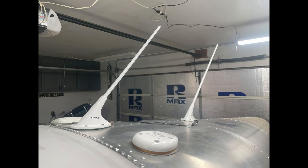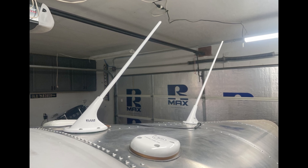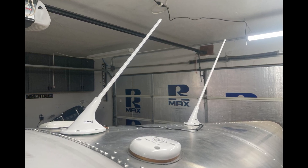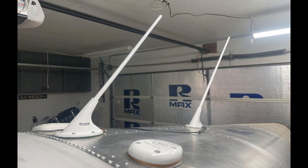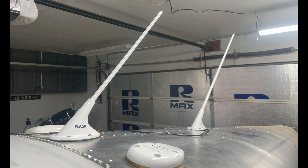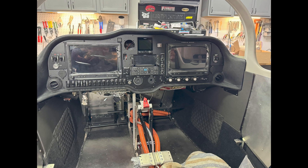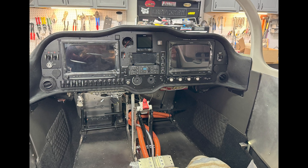Here's how we decided to mount the antennas. The forward antenna is the ELT antenna — we decided to go with a different ELT antenna. We split the GPS antenna, as you can see at the bottom of the screen, along with that square one on the left, to comply with Garmin's recommendations for distance between antennas. The mounting hardware all came with the Midwest Panel Builder kit, so again very handy.